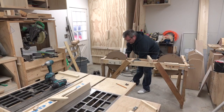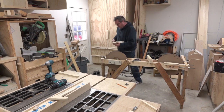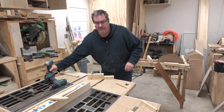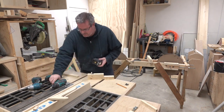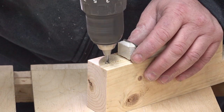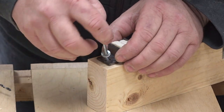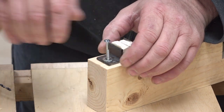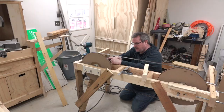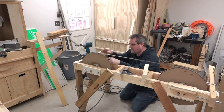Then I can take it off again, bring it over to the workbench, drill the hole, and drive the screw. Once these are in place I can still adjust them a little bit because I drilled the hole in the steel angle oversized. Now I've got the second guide on, clamped up tight where it's supposed to be.